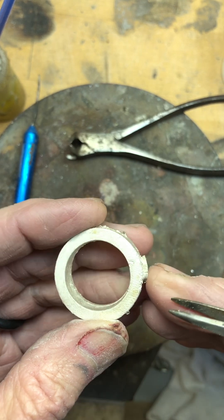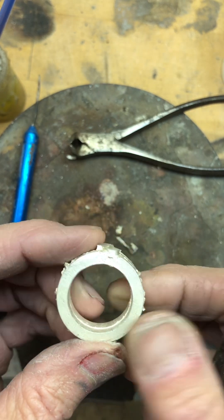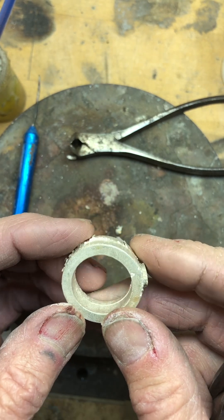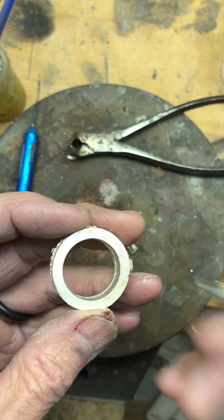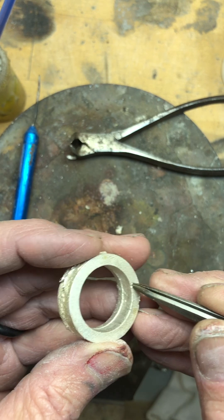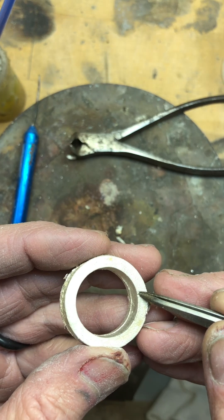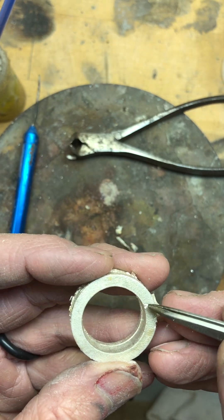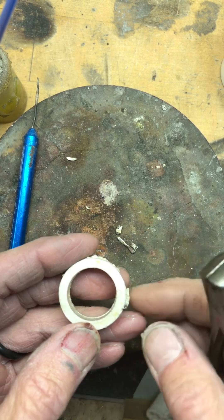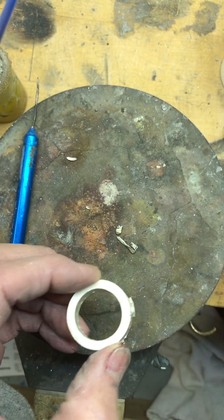It's got kind of a pitted area right there and a little bit right here. I actually want to hand engrave this once it's all done, just as a practice piece. I sand cast it in sterling silver. I'm going to show you really quick how to take care of these little spaces — we're not going to use solder, I'm going to fuse them. I took these little bits from the vents and I'm going to use those since they're the same metal to do this.